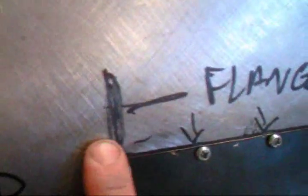It's all zip screwed in. That's the only way I could get the panel laid down flat. I'm not worried too much about it, because I'm just going to weld it up and close all those holes up. I made some reference points for me from this mark all the way to this mark. I'm going to flange it right across, and then on this little radius here and where he made a relief cut, I'm going to scribe it all in and butt weld this. I did the same thing on the other side and it came out all right.